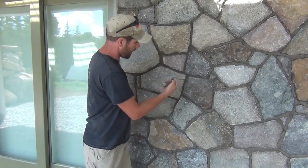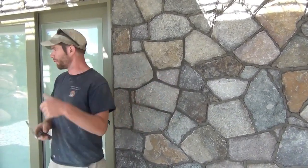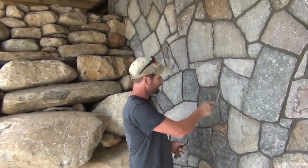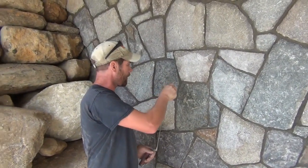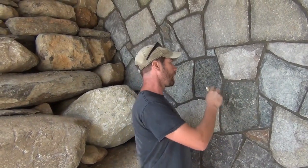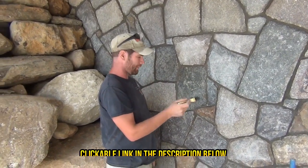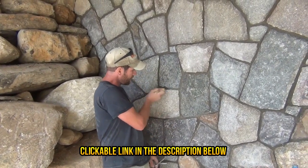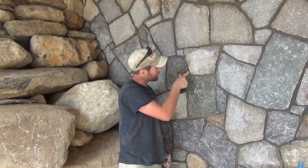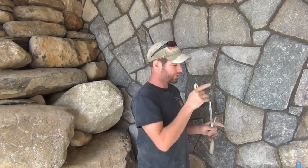Once the joints are tooled out the way you want, there's still one more stage — but it's a little too wet for brushing yet. Down here I've been working all morning, so we have different stages laid out. This section is barely brushable, pretty much dry — which is perfect, because now you can brush the joint without smearing onto the stone. I use a whisk brush — I'll put the link below — it fits in the joint perfectly, cleans up loose pieces, and gives a final pack against the stone for a good watertight seal.